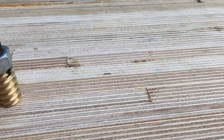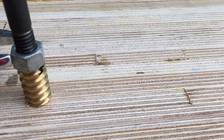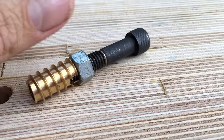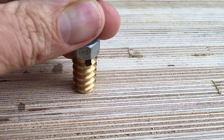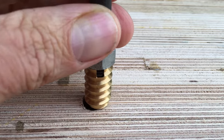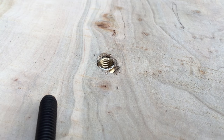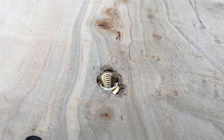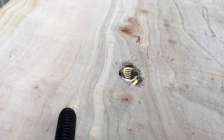When it gets tight, it will go down all the way flush exactly like you want on your work piece, because it stops at this nut. Then you take a wrench, loosen this nut, your work piece will come through, you can pull it out, take that extra nut off, and you're going to end up with a perfectly inserted wood insert nut with no boogered-up threads. Sorry it took me so long to figure that out.